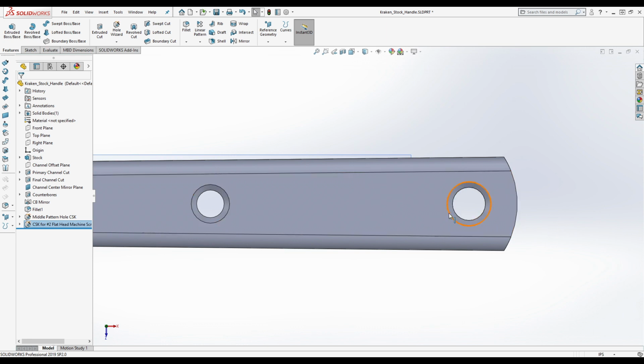And this actually is better to me because you'll notice that it looks like the same size chamfer. Right now, let me think. If you go from 5/32 to 7/32, that's a 1/16 of an inch, and you go from 3/16 to 4/16, which is a 1/4 inch, it's a 1/16 of an inch. So in fact, these are the same size chamfers, right?